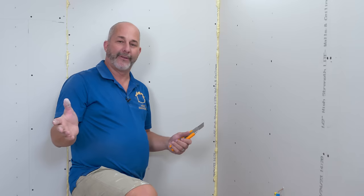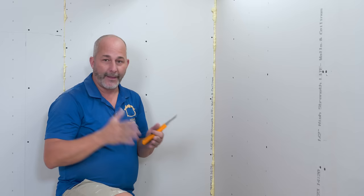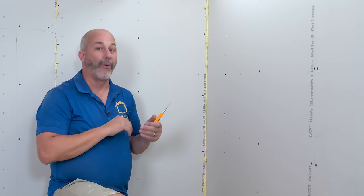Here's the deal — this house is built like this, okay. Every joint is a mess, so no matter how you drywall this thing you're gonna have weird corners. Using drywall only and then painting or adding tile can be a real nightmare. If you have wallpaper in your repertoire, you can use it to hide a whole slew of mistakes, especially if you don't use a horizontal line pattern.